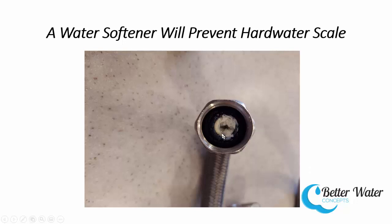The buildup can occur in your plumbing, in your valves, your dishwasher, your iron, and your shower heads. I had a shower head plugged with calcium carbonate once — the water came out like pins sticking me all over. I took a pocket knife and reamed out the holes to make the shower usable again, but it was all caused by hard water. So if you want a reason to get a water softener, protecting your plumbing system is a good one.